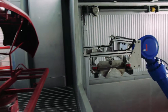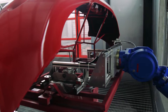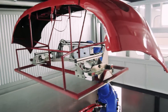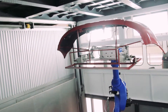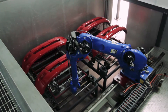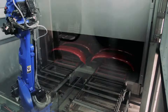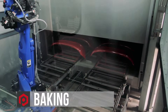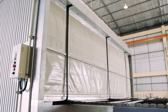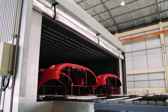At the end of the process, another robot will bring the parts and transfer them into an oven. The paint is fully cured inside the oven by hot air baking. The oven conveyor moves step by step and synchronizes with automatic doors at the oven entrance and exit.